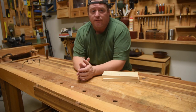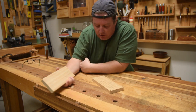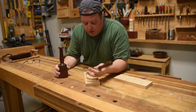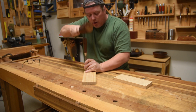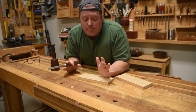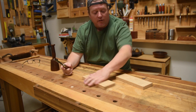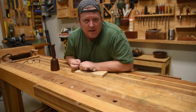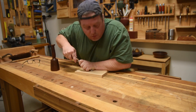There's a lot of stuff you do on a workbench that you really don't need any kind of clamp at all. If I'm chopping out the waste in a dovetail, all my force is going straight down, so I can just come over, secure it, and chop away without any clamping. There's also a lot of carving I do without any clamp whatsoever, because if I have enough material I can use my God-given gravity clamp and carve away all day long.